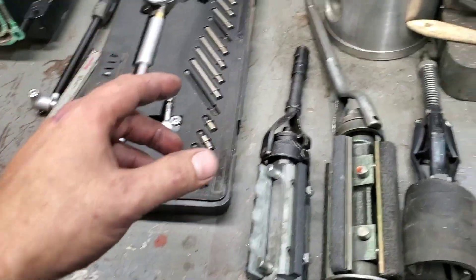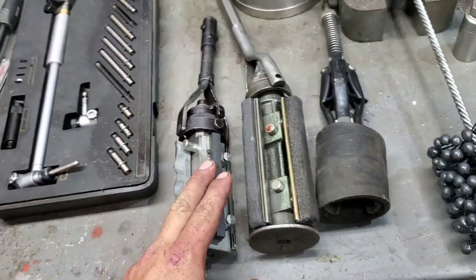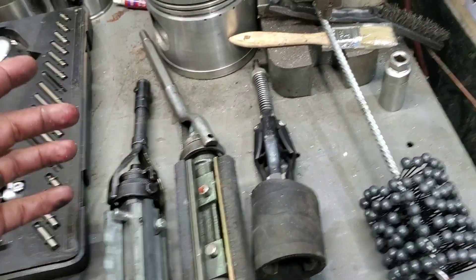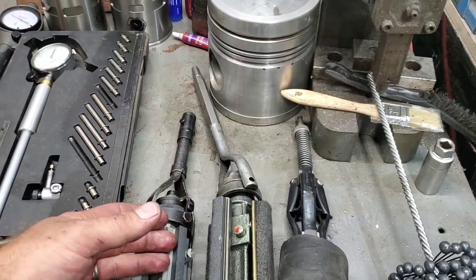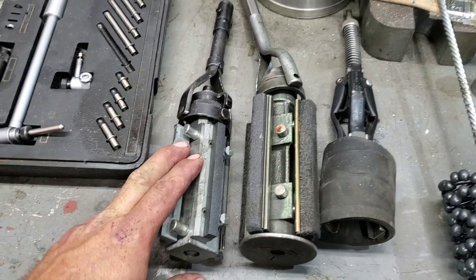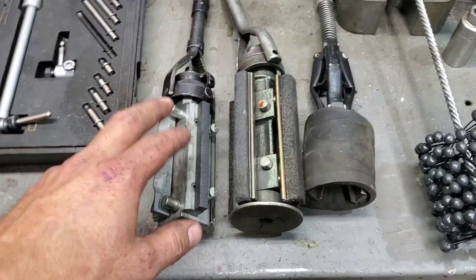This is the most precise way to size a hole. After you bore a cylinder, you bore it to the size of the piston and then hone the clearance. For a cast piston that's three and a half to four and a half thousandths; for a forged piston it's normally five to six and a half thousandths depending on bore size. So you bore it to zero clearance with the piston and then hone the extra out of it.